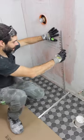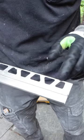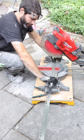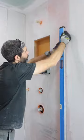In the shower I'm using Schluter Deco SG for a glass panel. The first thing I did was mark the position of where I want it. Then I clipped off the anchoring leg. This is really important because it prevents kickback when I'm cutting that with a saw. Also I needed a very square ending to it.